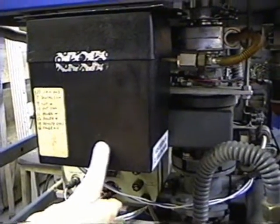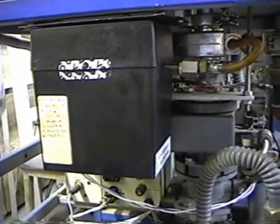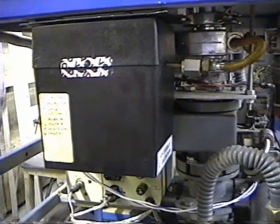These are very easy to use. You have a simple power supply of plus and minus 15 volts, and the output is 0 to 10 volts, linear scale with pressure. You can just put it into a digital meter and read the pressure directly in microns.